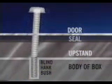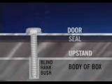With the alternative design, the lid fixing is achieved by utilizing threaded blind inserts in the body of the box. This proved impractical, since awkward out-of-view access and inconsistent lighting conditions rendered this fixing system unreliable, resulting in stripped and cross-threaded inserts.